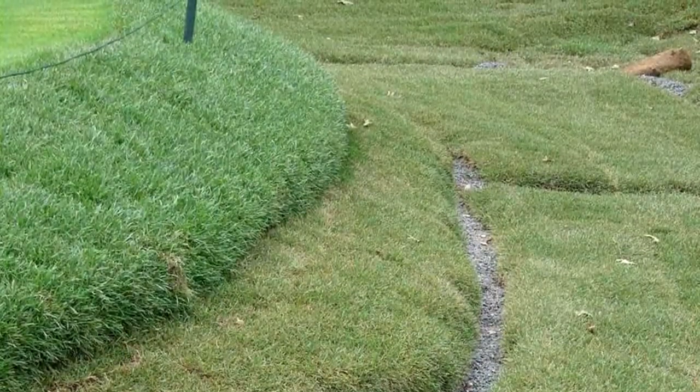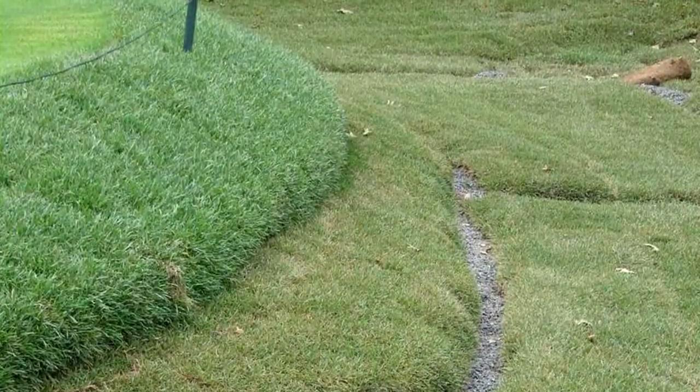The trenches are recessed nicely again, and this is all ready for sand. They even got caught in late year. Before they could put the Roundup, they had to put the sand in. The fall of construction, wrapping up the following spring. The grass is growing up through the sand. They just sprayed Roundup right over the top of the sand and went right into it and handled the grass underneath the sand in exactly the same manner, just as effective.